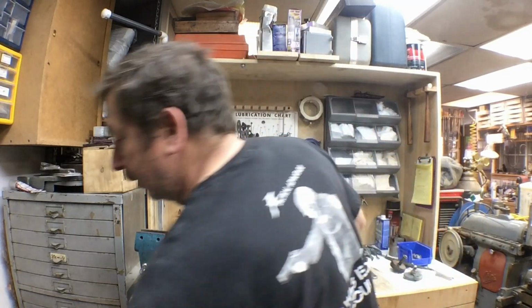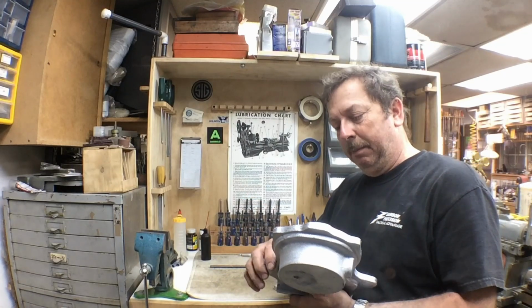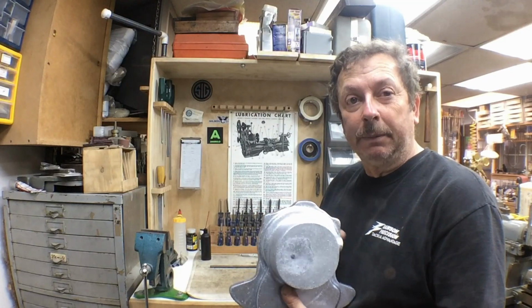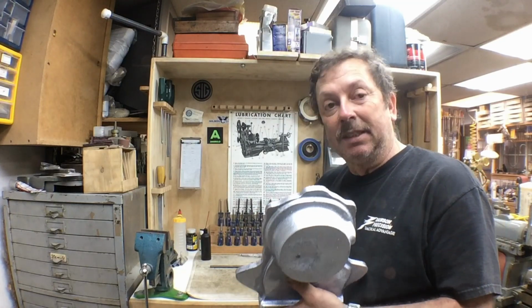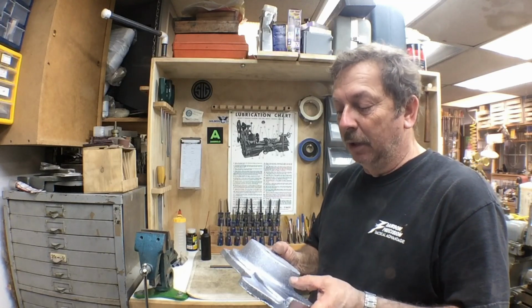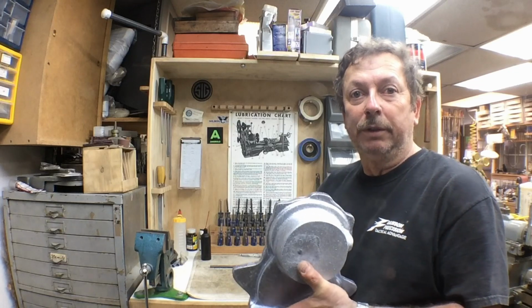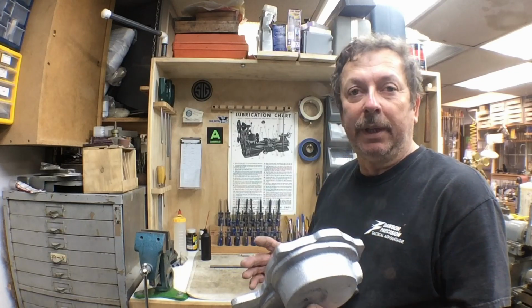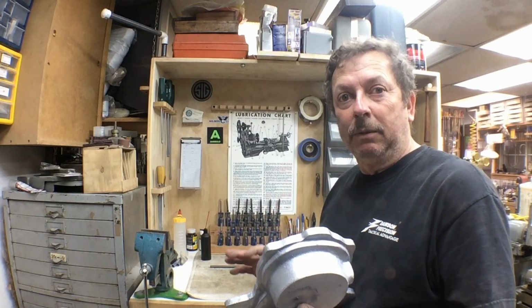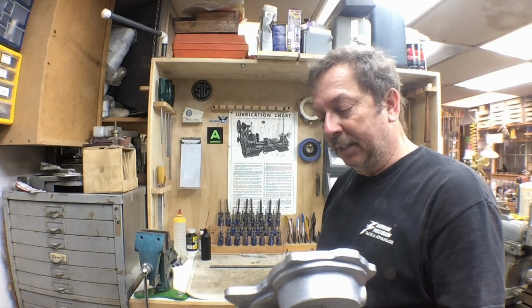Now, as far as the castings go, this is the first pattern that I rammed up before I started filming, and this is actually the second one that I poured. The logic for that is I wanted to pour the one that I knew was the better mold first, and then if I ran into a problem, if I ran out of material, whatever the case may be, I got hopefully the best of the two done. They're both good functional castings for what I wanted.